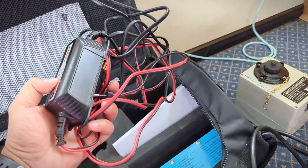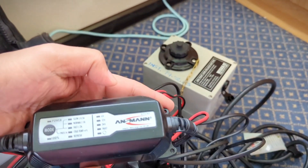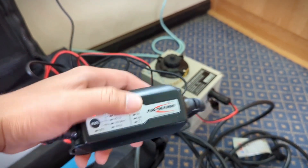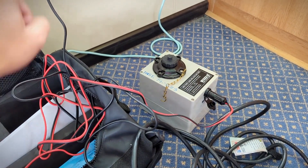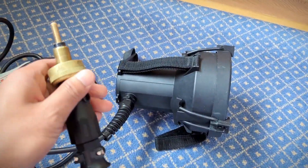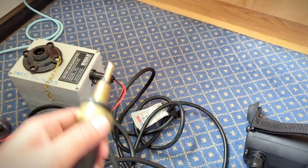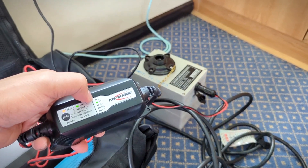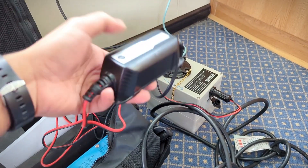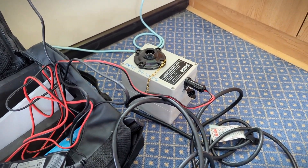This is the charger, this is the charging port, and the battery is still working. I have put it on charge and you can see the full board. What may happen is while you are charging and also trying to use this Aldis lamp at the same time using this port, it will turn to 6 volts automatically, and either the battery or the charger may be permanently damaged.